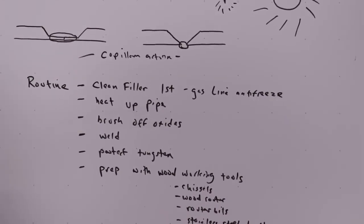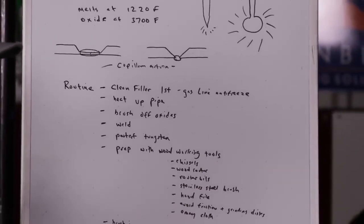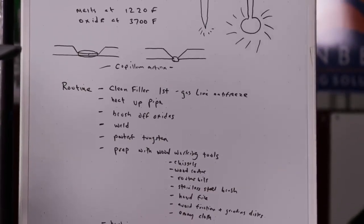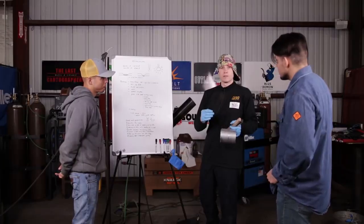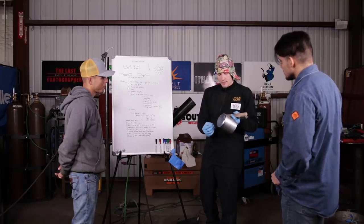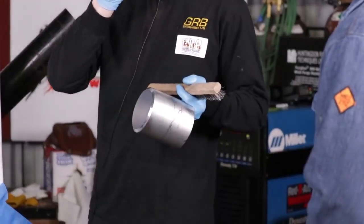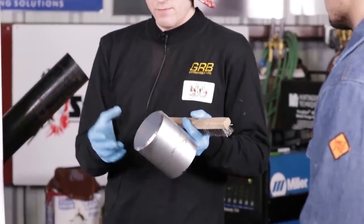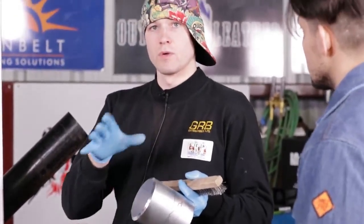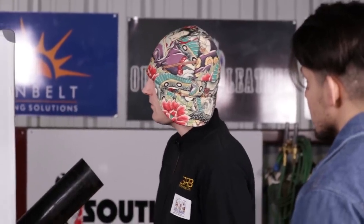Can you backfeed it? Oh no, aluminum in general is very difficult to weld, but I have found in practice while trying different welding techniques that when trying to backfeed, the electricity seems to know where the filler metal is, and even if I'm on the leading edge, the arc will heat up the filler metal and arc out to various parts on the material. No, I understand that, yeah.